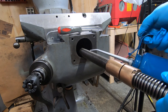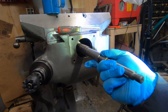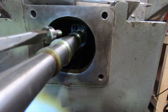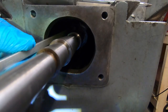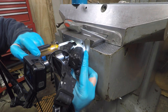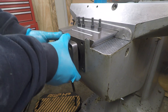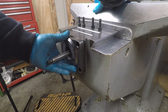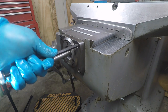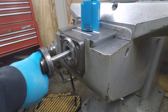Putting some oil on the feed screw for the saddle — I've already lined up the keyways on the split nut and I can go ahead and push it into the bracket. It's tight quarters and not a lot of space to get this feed nut retaining screw into the bracket, and trying to record it makes it just that much more fun. With the feed nut and screw secured, I install the bearing bracket for the feed screw — held in with four socket head cap screws — then slide on the dial, the dial lock, and the handle, which is secured with a nut.